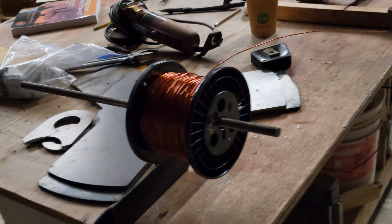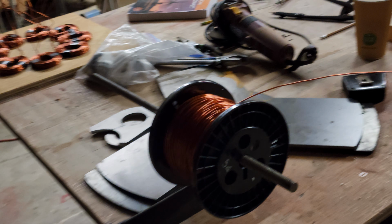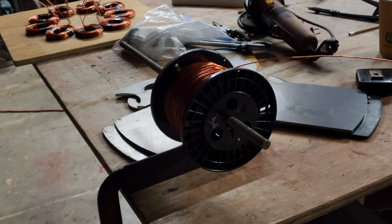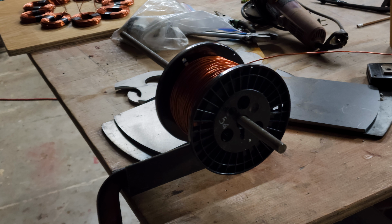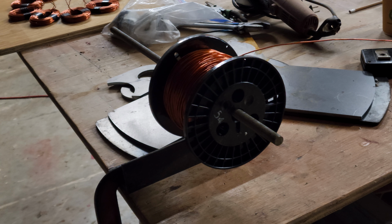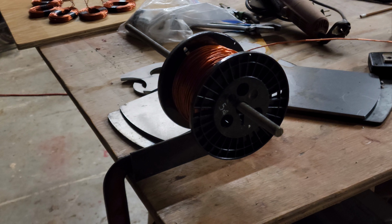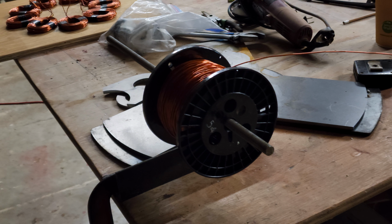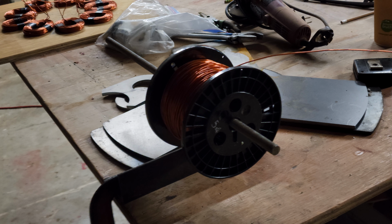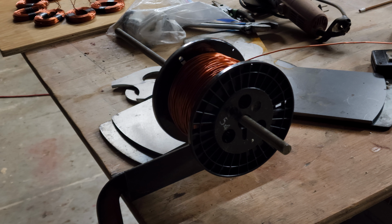This is the coil winding setup. The small machine we wound with 70 turns of 14 gauge wire, which should make a pretty honest 500 or 600 watt alternator. It'll be good for twice that for bits of time, but sustained output should be 24 volts. And sustained output should be safe around 600 watts. So we'll hope to start furling about then.